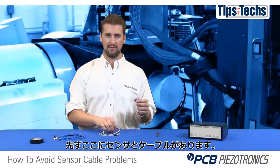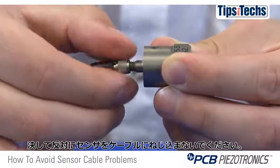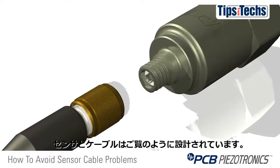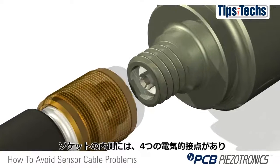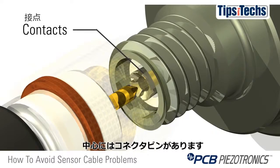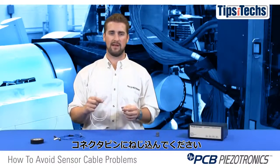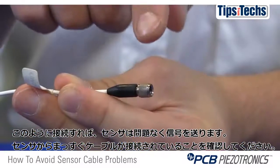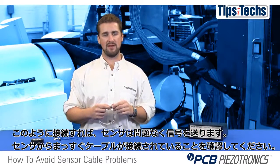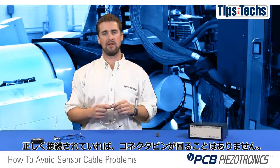So to start we have a sensor and we have our cable. You want to take the pin of the cable and screw it into the sensor. Do not do the opposite — do not screw the sensor into the cable. The sensor connector is designed a certain way. Inside the socket are four electrical contacts that are concentric with the cable connector pin. These contacts can be damaged if the sensor is screwed into the connector pin. Using the cable's floating coupling nut to screw the cable onto the sensor ensures that the pin is driven straight back. Neither the sensor nor the connector pin will spin when you connect them the correct way.